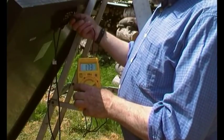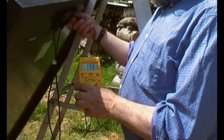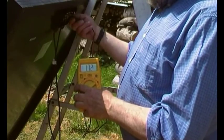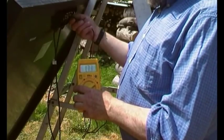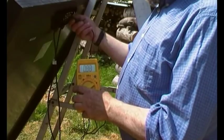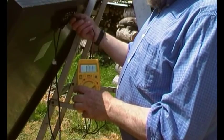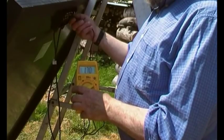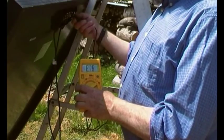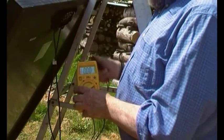The next thing is maybe we've got a drop in voltage under short circuit current test, because one set of wafers won't give the current. We were getting nearly eight amps to start with but then it went down to about six and a half amps. In full sun it's only 1.7 amps on that last set of wafers, while the two middle connections and the two outer ones both give nearly nine. Interesting — we're going to have to test this in circuit somehow.